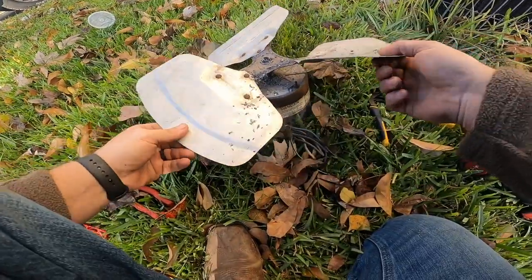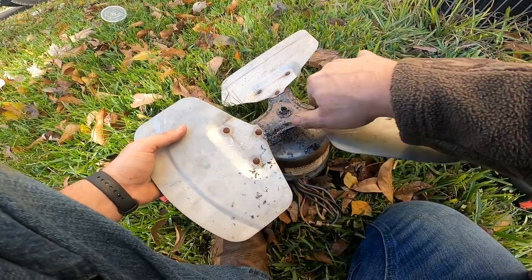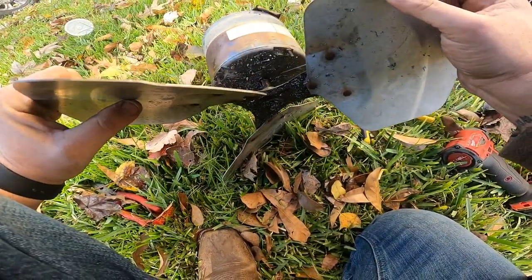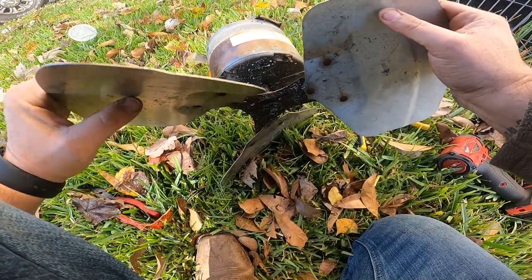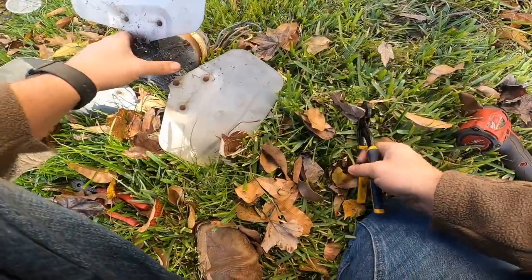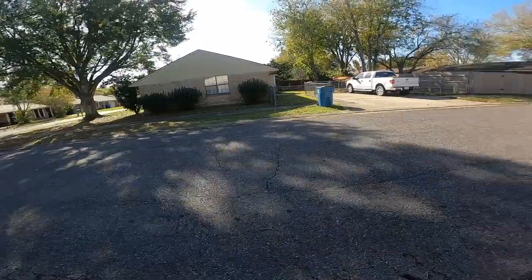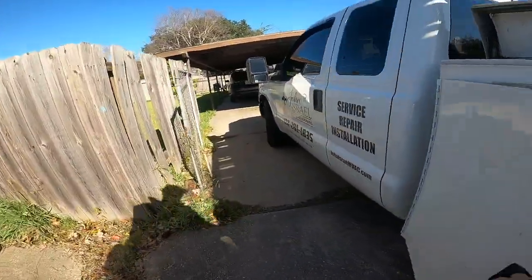And you know, I just thought about it, guys. Even if I wanted to put a puller on it, I can't because the blade is upside down. But I have done everything that I know to do to get this blade off. I'm gonna go attempt one last thing. I'm gonna take my turbo torch and I'm gonna put some heat on that hub and see if I can get that hub to expand a little bit.